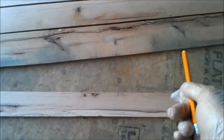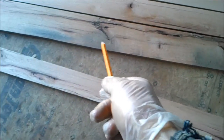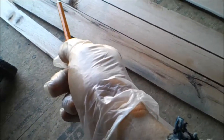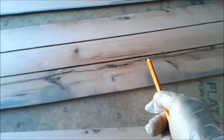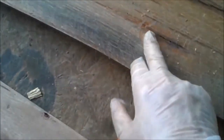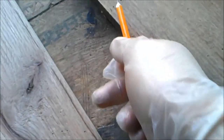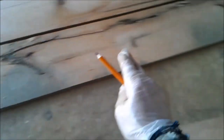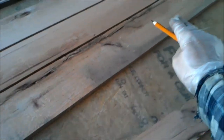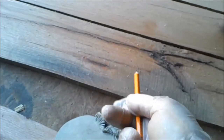This piece right here is pretty good too, but we have a big knot here, a substantial knot here, and another one here. So I've got a workable piece from here to here and here to here from which to get stock. This piece has some weathering — it's set out and looks kind of rough from the grain. It is also a quarter-sawn board against the grain along the pith, so there are a couple of inches along that edge that are not really usable. But if we can run this through the planer, we've got some natural wormy holes that will add character. The flecking in the quarter sawn makes it beautiful — this might make the vertical uprights.